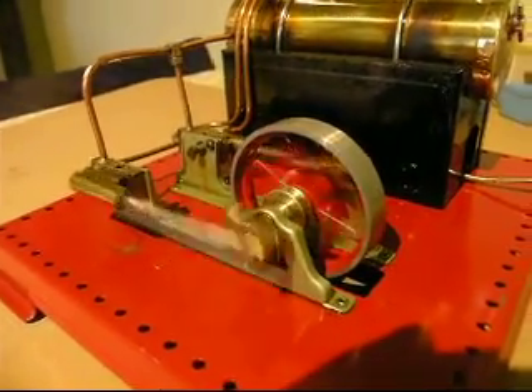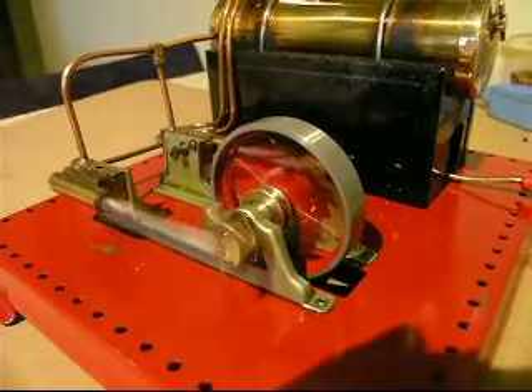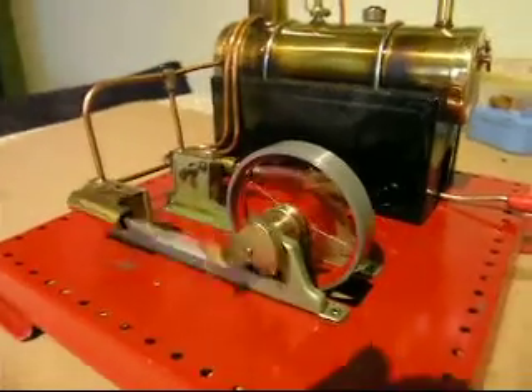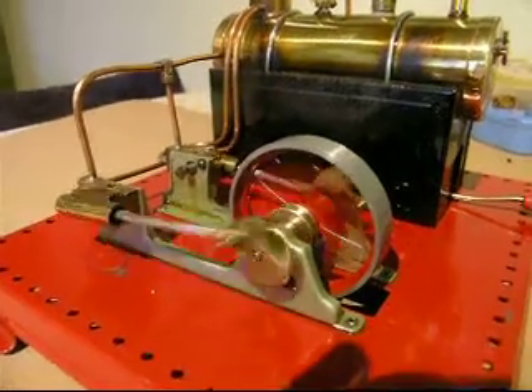I've come to the conclusion of that whistle design — that's what's sticking and leaking very small amounts of steam. It's taking enough pressure off not to deprive the cylinders of that extra bit of pressure to give them at least some oomph to turn over.